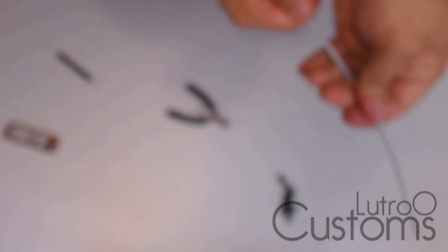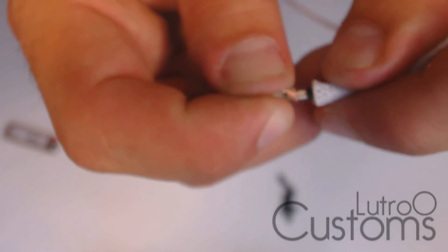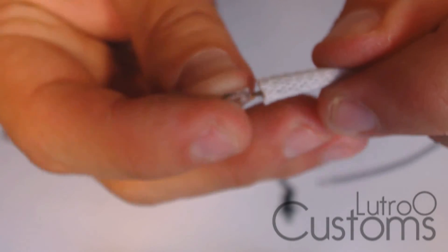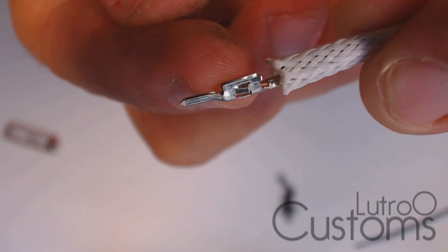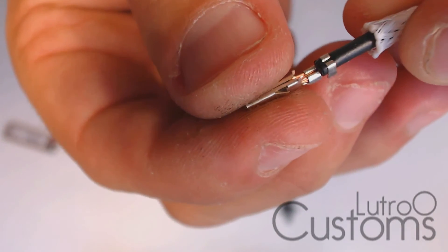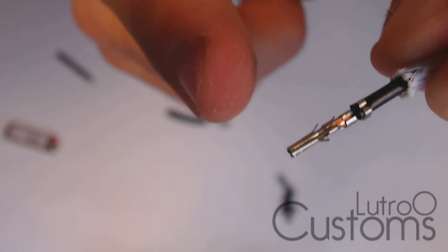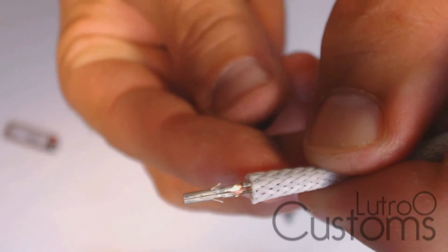The positioning is the same for the female pin as for the male — the crimp is the same, just a different gender connector. We put the sleeve right above the first crimp just like before, then push it down to get it seated properly in the right spot.